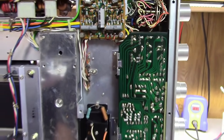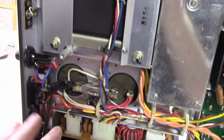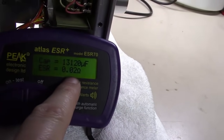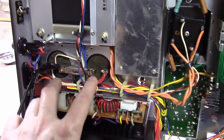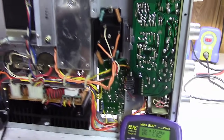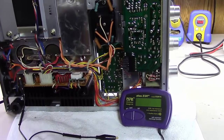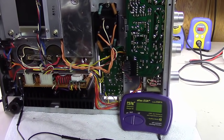Similarly on the output boards I'll replace those capacitors, check the FM tuner alignment, and just get the thing in top-notch shape so it'll last another 20 years. Right up front you can see I'm testing the big electrolytic capacitors with an ESR meter — they both tested great, extremely low equivalent series resistance and about the right capacitance value. I'm pretty happy I don't have to replace those two big caps, and I'm pretty sure the customer will be too — that can get a little pricey.